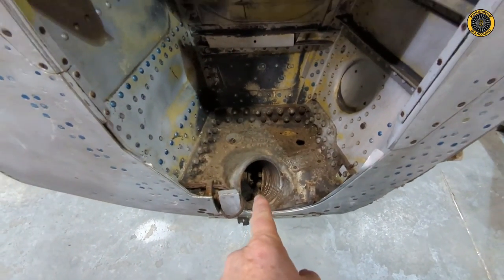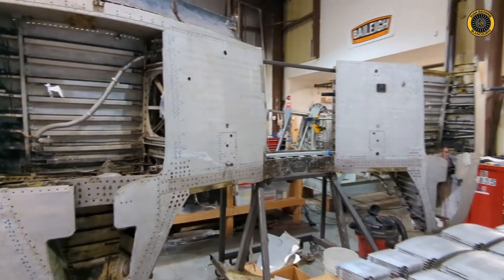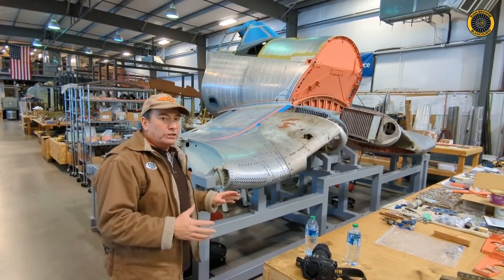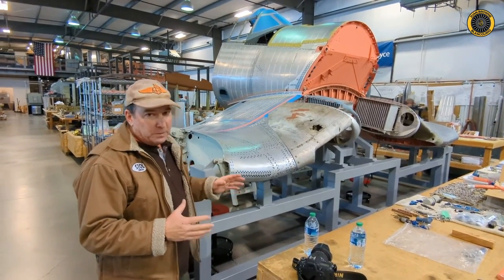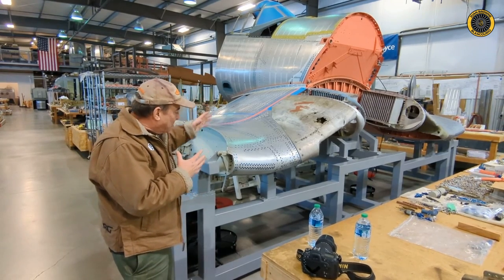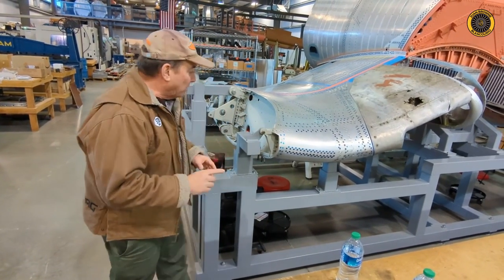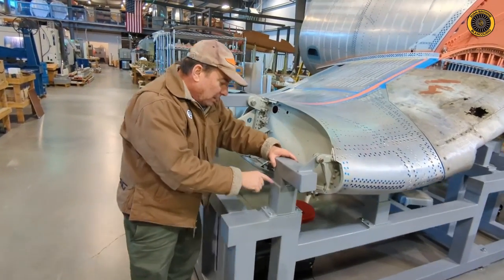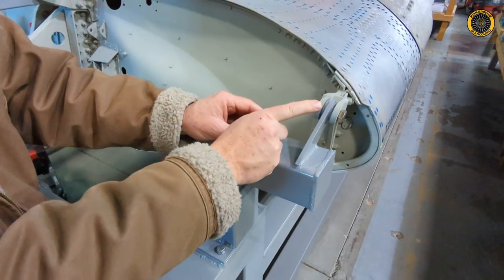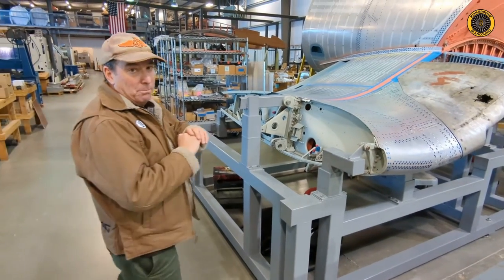Here's another look at that landing gear mechanism, and here's where the dive brake board is on the front of the landing gear where it recesses into the center section. So how do you jig one of these aircraft up? You've got to create your own jig from scratch — not from the drawings, because the drawings are simply not accurate enough. You've got to take an existing aircraft that's in good shape and build the jig around it. You weld up the jig, but as you weld things move, so to get the final fit you epoxy these parts in a slow-setting epoxy to get each point exactly located. Do that with each of the main attach points and you now have a jig to build multiple aircraft with.